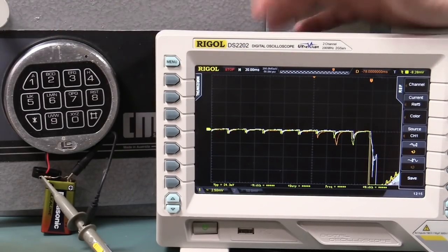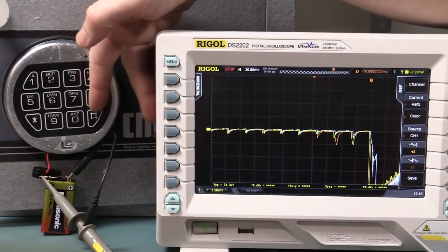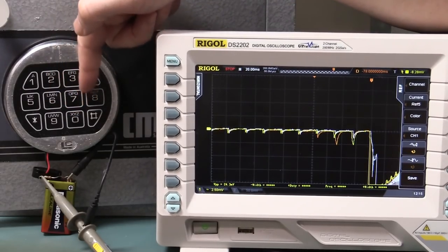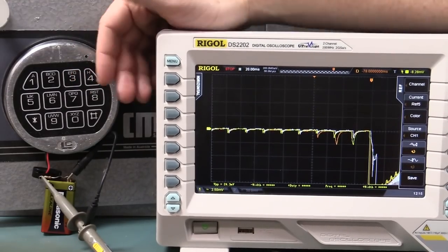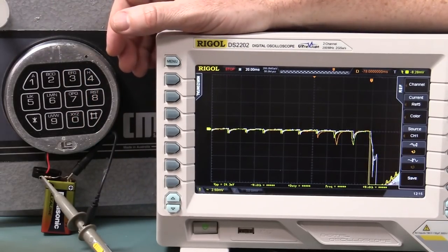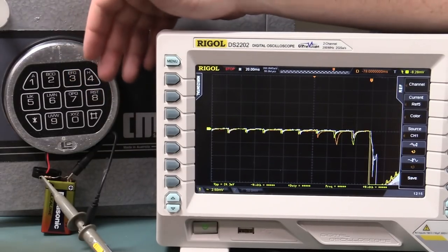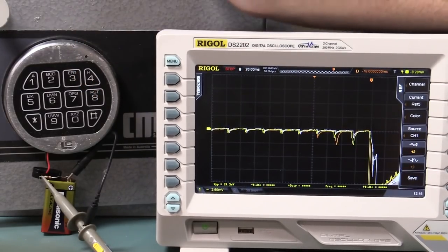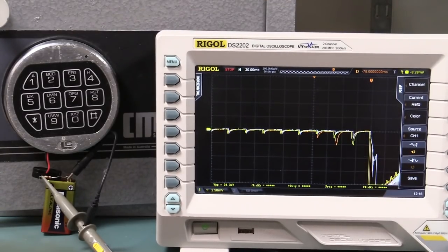If you use much more advanced power line attacks, people have talked about seeing maybe the I squared C bus for this keyboard, which might be in parallel with the one at the back. Nah, I pretty much don't even have to test that. This is one of the best locks on the market, this Lagard one, as I said before. And if it was that vulnerable that you could read the code out of the E squared PROM, which was hooked onto the same bus as the keypad, then that would be a well-known exploit. So I don't think they're that stupid.